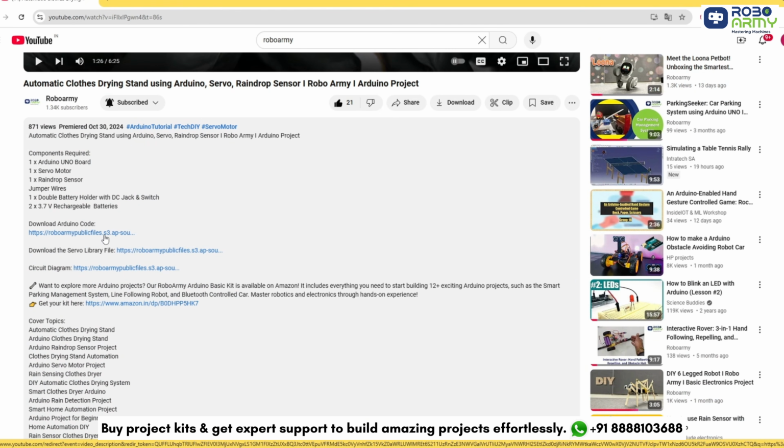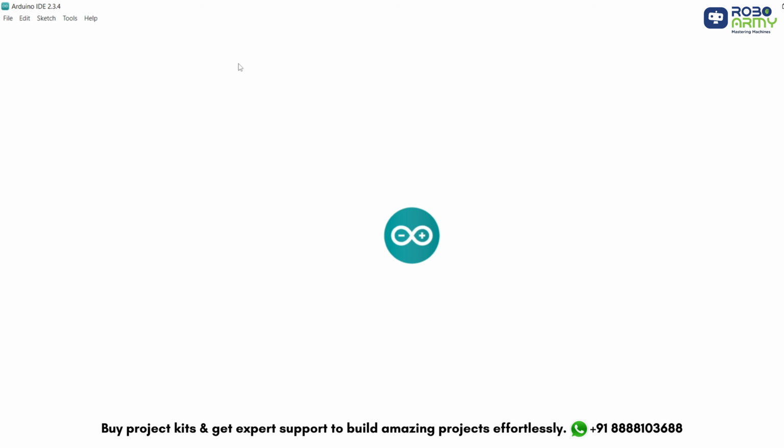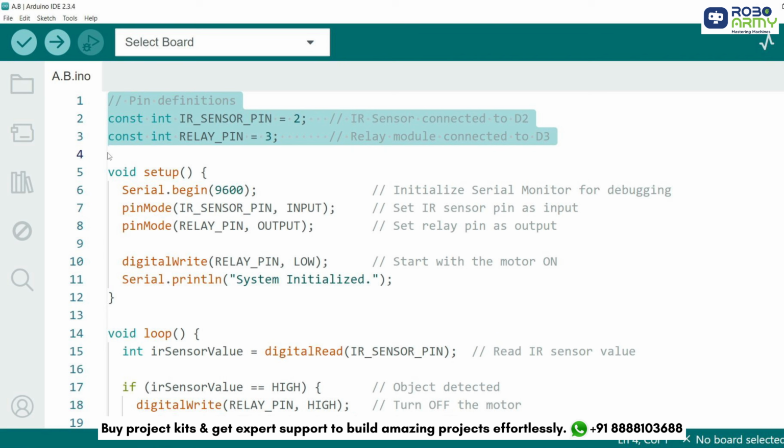Now download the code and library files given in the description below. Open the code file in the Arduino IDE. We start by defining the pins connected to the components. IR_sensor_pin is set to pin 2, where the IR sensor is connected. Relay_pin is set to pin 3, where the relay module is connected.